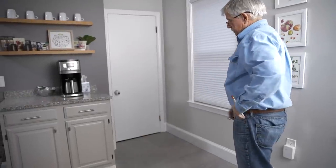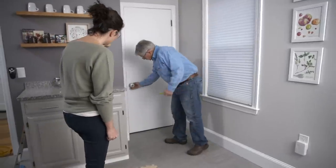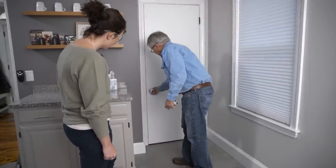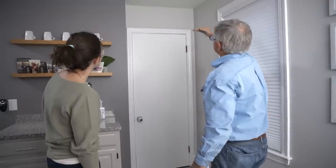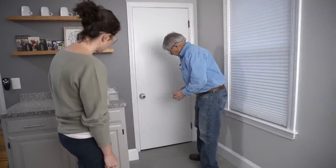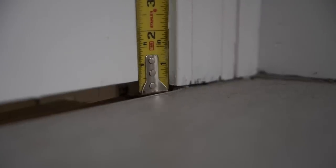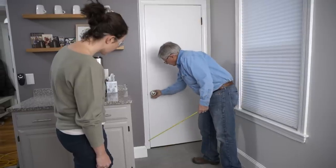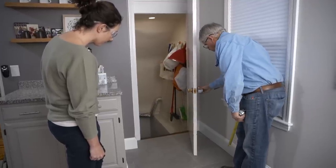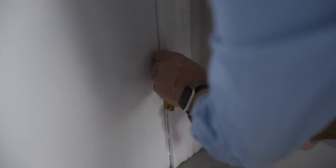Our toe kick is in around the cabinets, now it's time to tackle the second project — the door. It looks a little different underneath; the spacing hits the floor way back here. I can see the door has settled down, so I can't just take a level and mark off the door. The gap here is a half inch to the floor, and where this door hits the floor on the other side — if I take a half inch off tapering to nothing, it should open the same amount perpendicular to the wall. Let's get it off the hinges and cut it down.